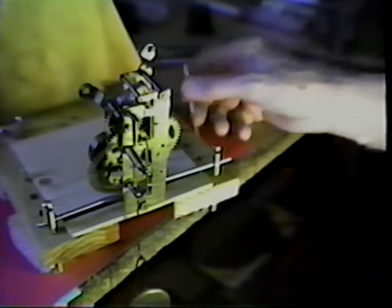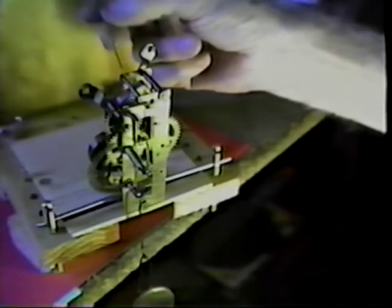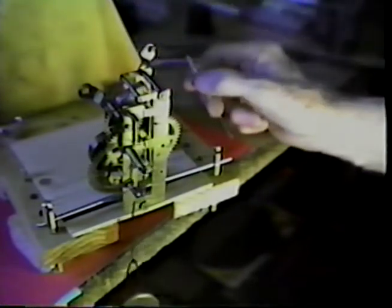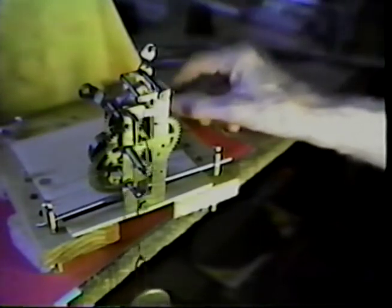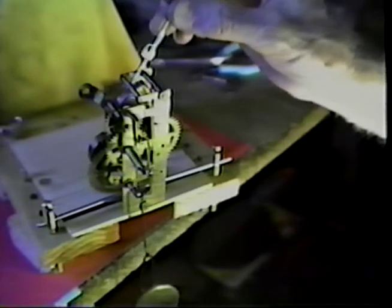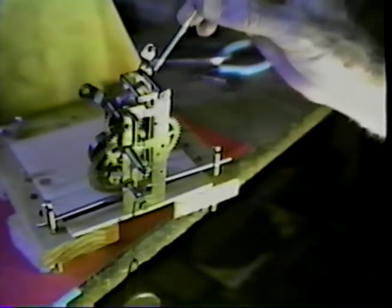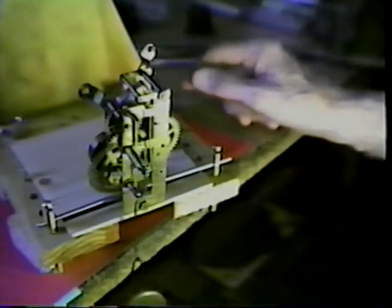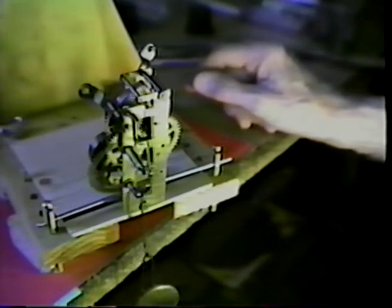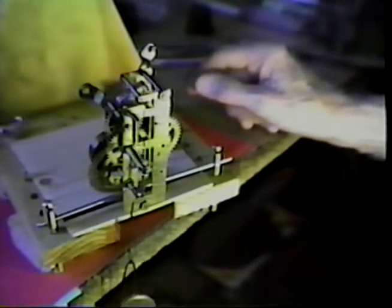I usually send this into the water arbor end first, so that both ends go into the water about the same time. If you go in flat side first, one of these flat surfaces first, then there's a possibility that you distort the shape of it. So I will give this the heat treatment, then we'll look at it, then I'll polish it again, we'll place it in the movement, and take a look again. Be with you in a few minutes.